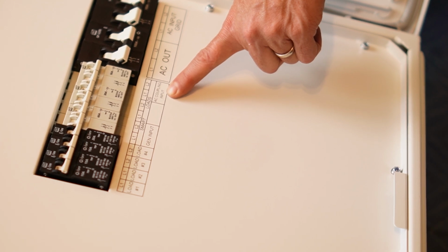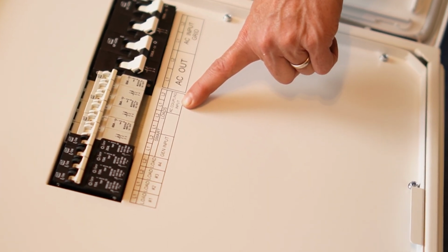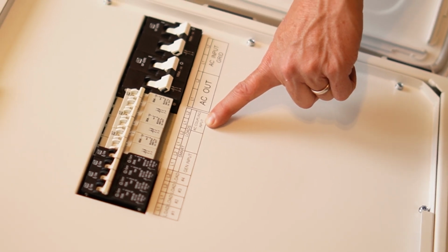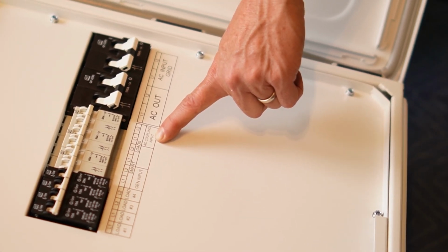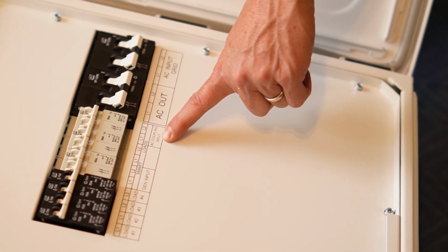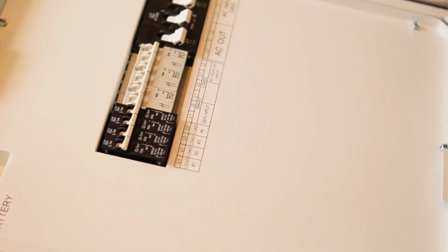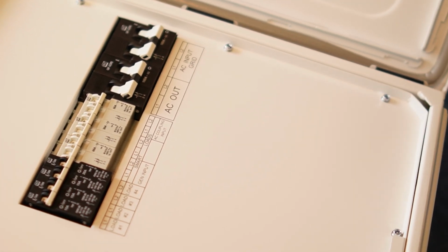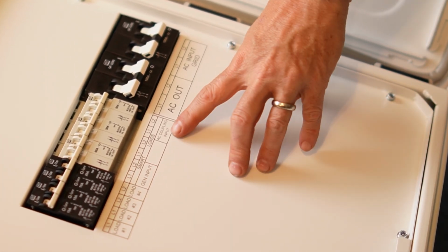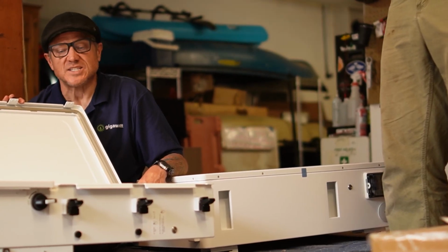And then the MidNite can control the Enphase microinverter's ability to be on through what is called a frequency shift or frequency dithering. In an off-grid scenario, it will change its output frequency in order to throttle the grid-tied inverters one way or the other. This is like $500 worth of AC breakers.